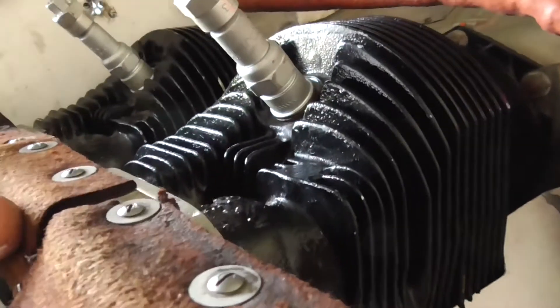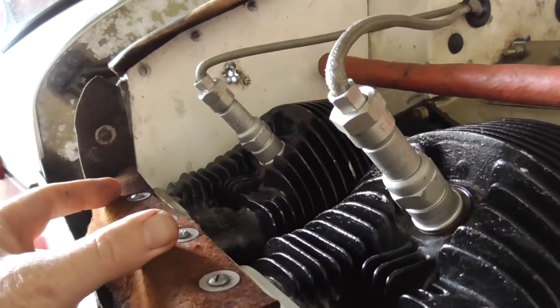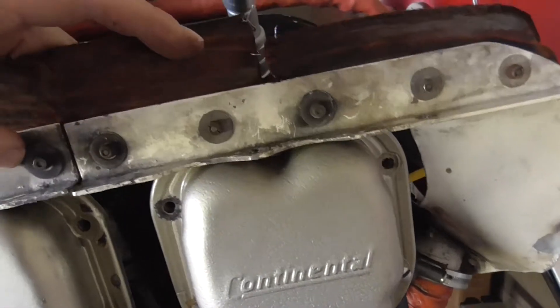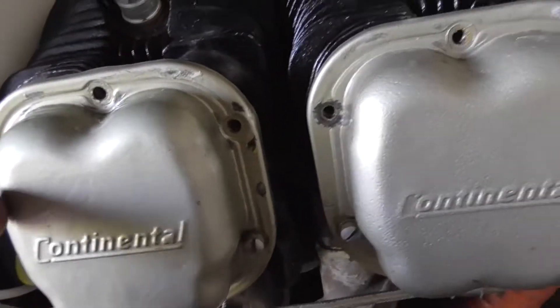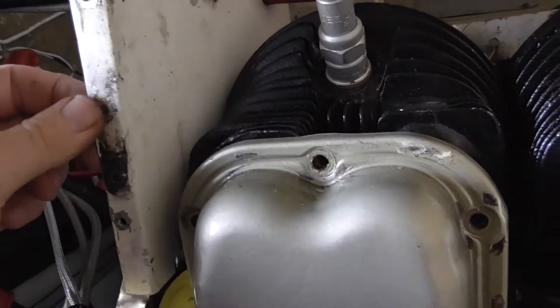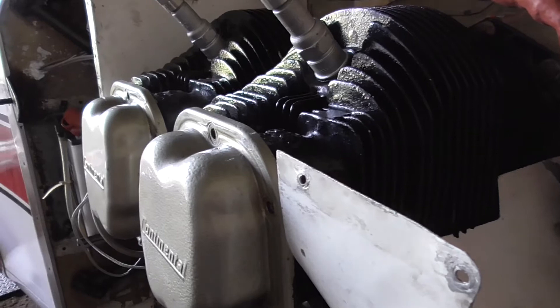And then having something that will come up like that. I've now released all of the rocker box screws that hold this particular bracket in place, so I can lift that bracket away and put that on the carpet. What it now means is that I can make the cardboard template up which will sit, hopefully, fairly snugly against there, up onto that bracket and onto that chin bracket for the front there, and then, hopefully, that will do a better job of it.